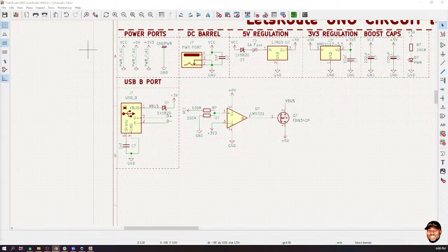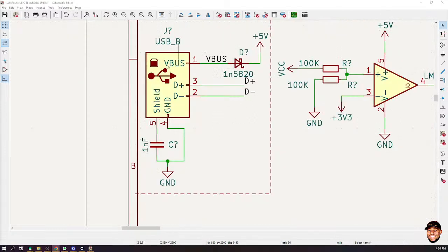Where we put these things, you can't actually put capacitors there. For instance, we are supposed to put a TVS over here. If you put a capacitor here, you would distort your signal, because this signal is supposed to be changing, 0 1, and we know that capacitors don't allow a sudden change in voltage. So if we want to deal with transients or even this kind of uncalled for spike, we can't use a capacitor in this situation, but a TVS can ideally be used here.